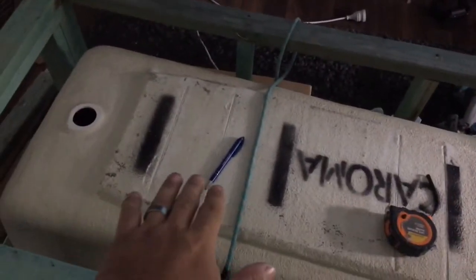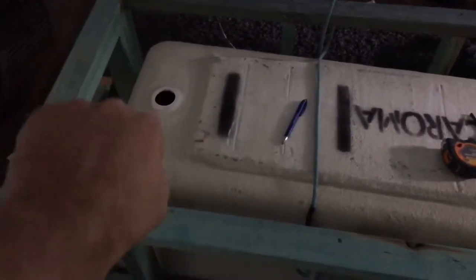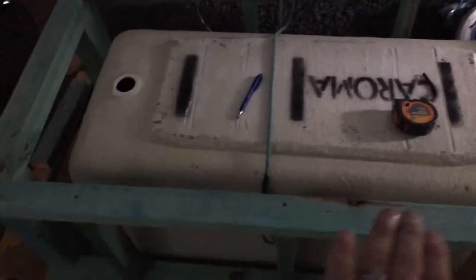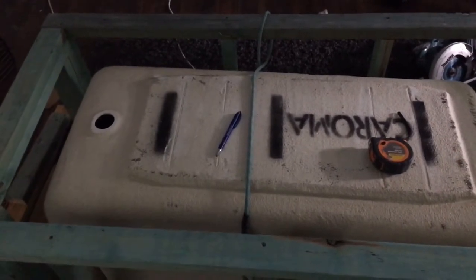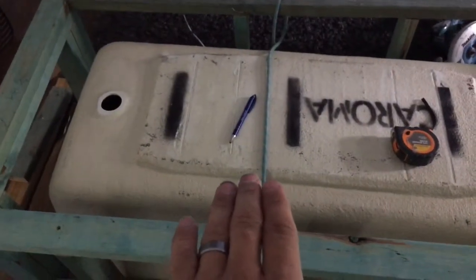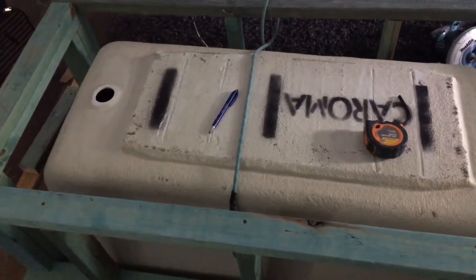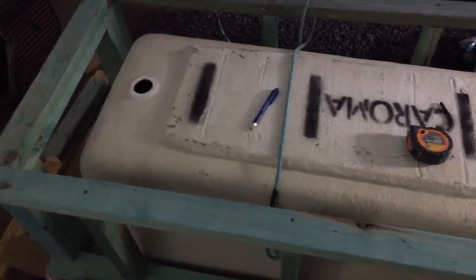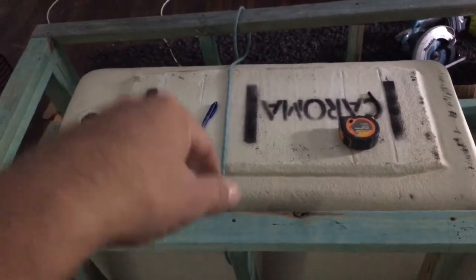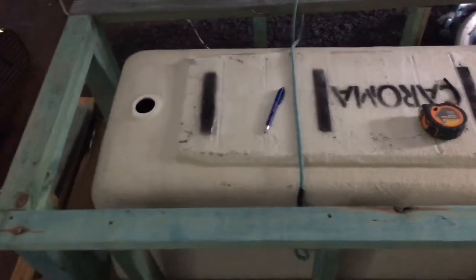This is upside down obviously, and then your mortar bed goes in here. You've got to build a little form — there'll be one there and one there, with nothing right around the plug hole. I'll use timbers and cement sheets. To save mortar, I'll put timbers across that way, screw a cement sheet to the top, then put mortar on top — that way I'm not using a heap of mortar. I bought six bags but you always use way more than you think, so doing it this way should mean I won't need a whole lot, and then you just leave it to dry for a nice snug fitting bath.